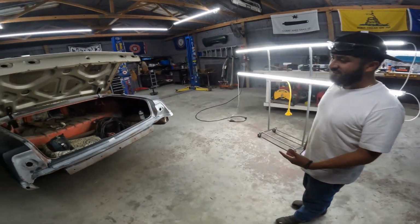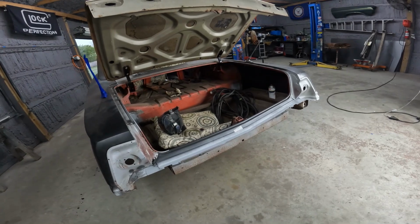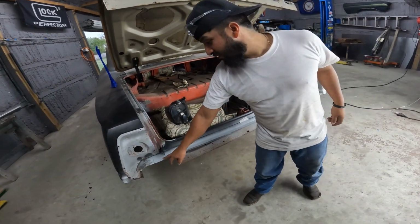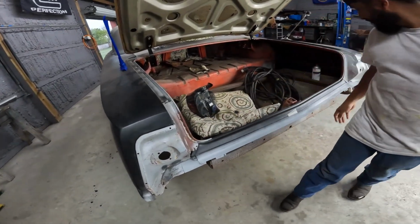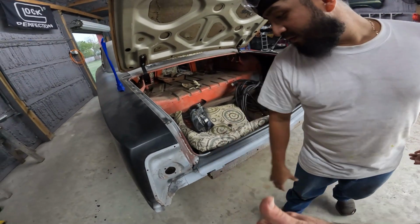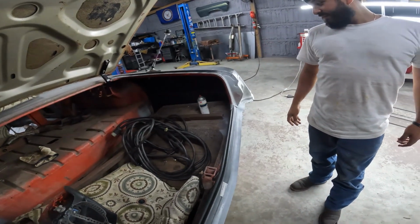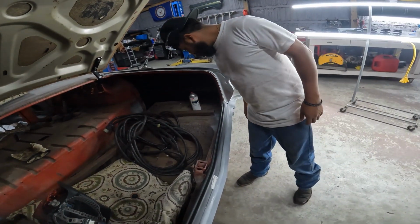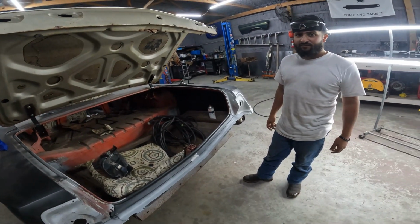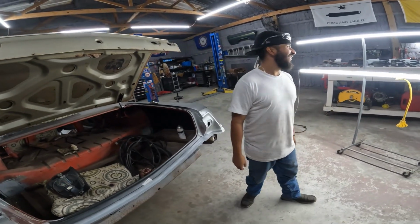What'd you say? It looks the same. It does. So what'd you do, man? Recap. Cut the old one out. Fix some of these areas beneath this. Made those pieces under it, both corners, which is essentially the body mount. That's why it rusted. And then put it in, and then put this piece you got from Classic Industries. How much did that cost? Well, I have no idea. Like $2 bills. I'm gonna be checking my statements. Man. Wow. Okay.